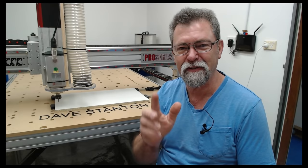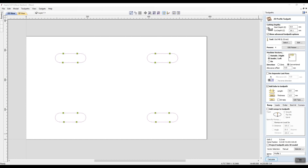All right, so we're going to go back to the Vectric again, to Aspire, and I'm going to give this a name. What will we call it? Let's call it, I'm going to go in caps so it's easier to see, SLOTTED HOLES, and 6.35 MM EM. That's 6.35 millimeters end mill, I'll know what tool I've got to have in there, and then I'm going to put the date. So for me, it's the 8th of the 9th, 2018. Okay, that should be pretty good.